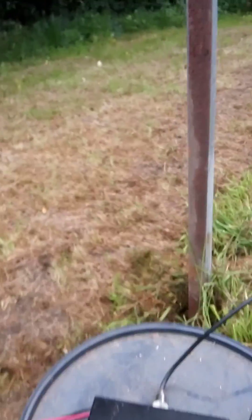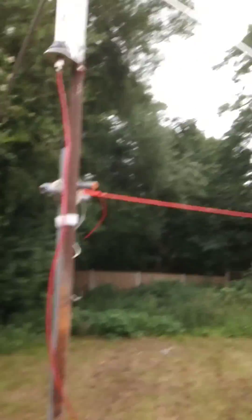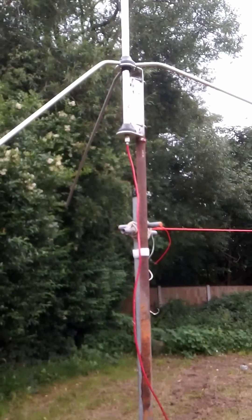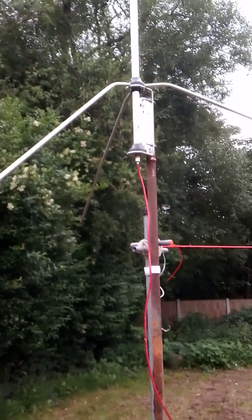Not bad, that's about right now. So by lengthening the antenna slightly, as you can see from that yellow mark up there, I've managed to tune it so it works fine with these ground radials. It's a lot lower than it was the other day with the standard ground radials. I'll put it up soon and I'll let you know how we get on.